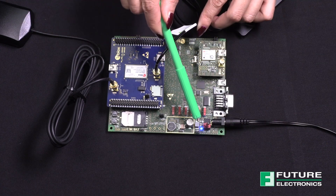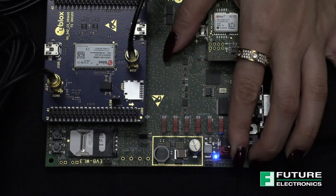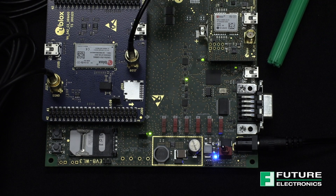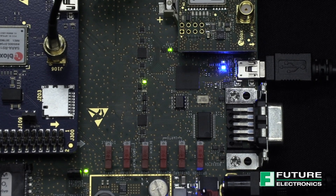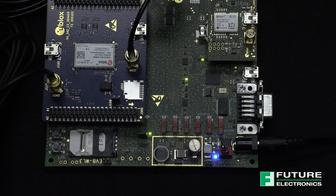The LED should light up blue. To enable the board power supply, flip the main power switch to the ON position and the LED will light up green. Next, to communicate with the SARA-R5 using the UART interface, use the USB port on the EVB-WL3 — the big board — marked as J501. The LED turns blue and two COM ports are enabled. The main UART interface of the cellular module is over the first COM port opened by the driver.